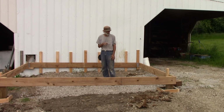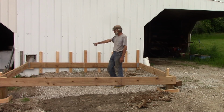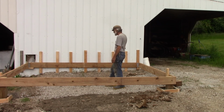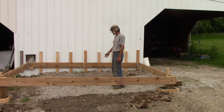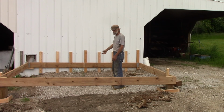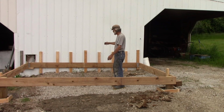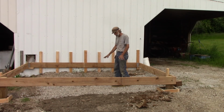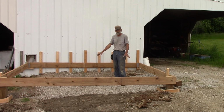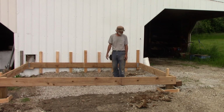My next stage will be to put in my joist hangers for the 2x6s, and then I'm going to run some metal along the bottom of that that slopes out this way, so that it ensures that any water gets out, because the drain on this thing is just the floor. It's just going to go right through the floor. Setting the flooring at 1/2 inch gaps, so it'll just drain through the floor. So that metal will make sure it gets pushed out here onto the gray water tank. So, yeah, away we go.